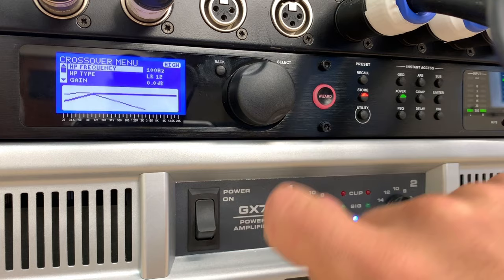There's also a low-pass frequency for the tops. If you've got top boxes that only go up to 16 kHz, you could roll off some of the sound there. I've got mine going all the way to 20 kHz. You can see I'm rolling off the very high top — it sounds awful, but just showing you that you can. You might set that to something like 16–18 kHz if you think your tops aren't really producing anything above that. To be honest, above 15 kHz there's probably not much audible difference anyway.